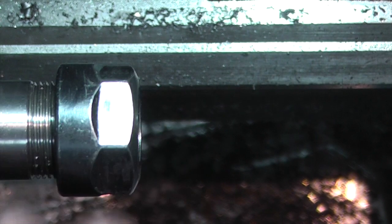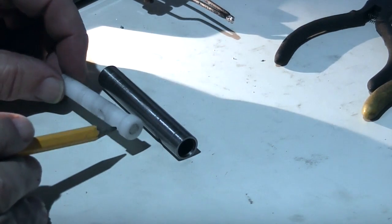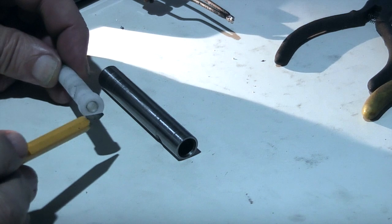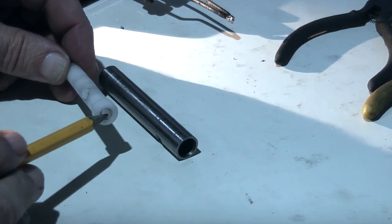The probe is finished. These are the finished parts and I'm going to assemble them — I've made a few modifications. On the plastic part, what I've modified is I've added a 5mm wide by 14mm diameter section to give me more plastic around the thread to stabilize the probe a bit better.